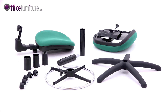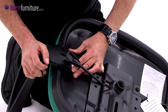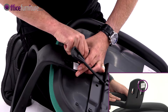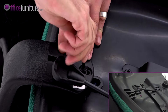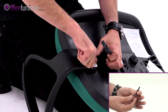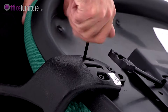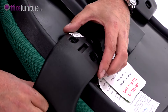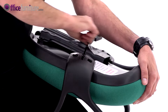If arms are not required, you can skip the first few steps. Turn the seat pad face down and position the arms — each arm is marked underneath with L or R to indicate if it's left or right-handed. Place the washers over the bolts and insert the bolts through the holes in the arms into the seat base. The longer bolts fit through the arm holes nearest to the outside of the chair; the two shorter bolts fit through the remaining arm holes.